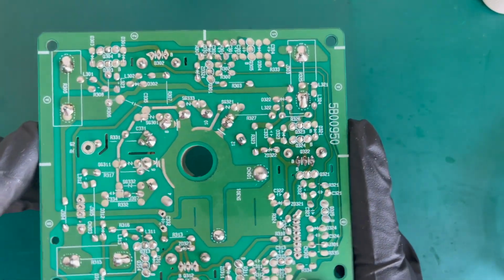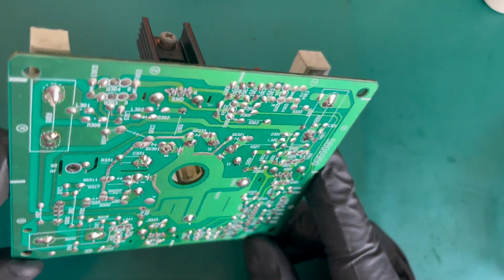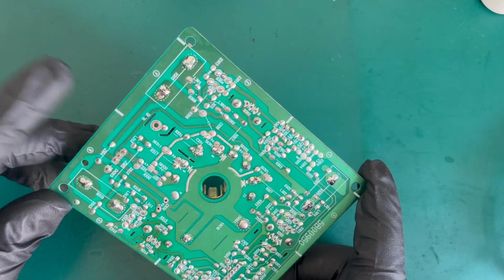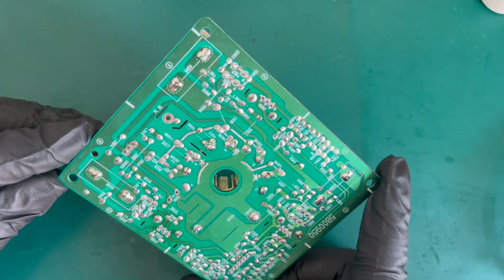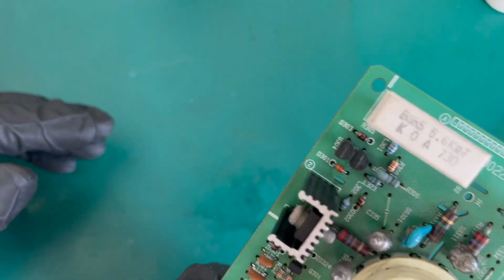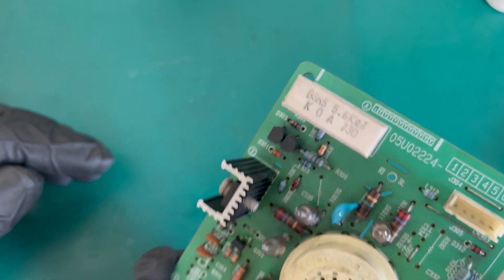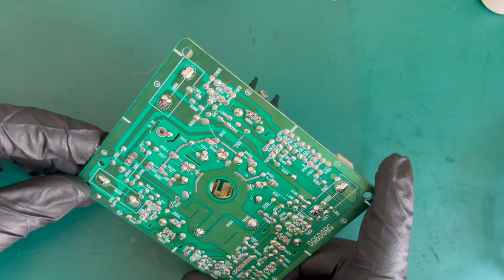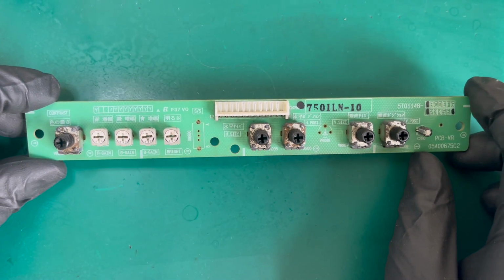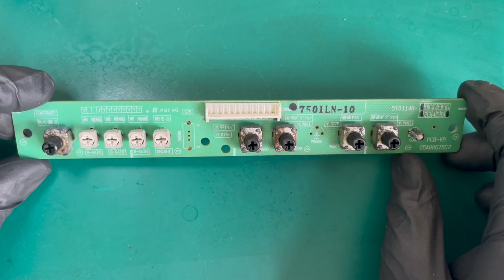And I think that looks like a really clean board. Obviously I've completely neglected to solder in the transistors, which is pretty important. So I'll probably do that off camera in a second. And just look for dry joints, sort those out, and that will be done. So I'm finished with the neck board for today, and I've put that to one side. Obviously we've documented the capacitor that was on it, reflowed anything that looked a bit iffy.